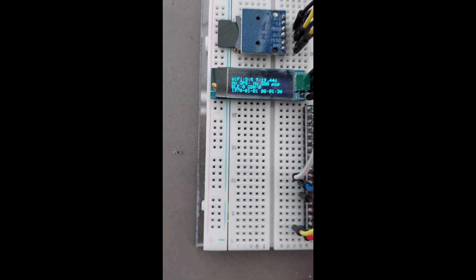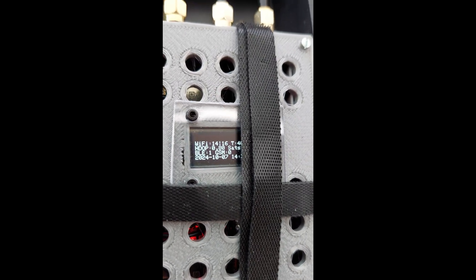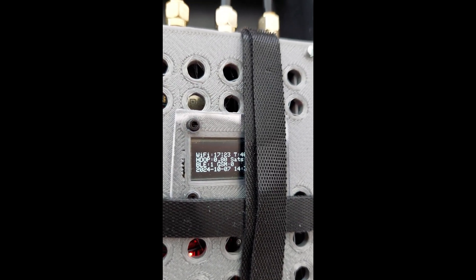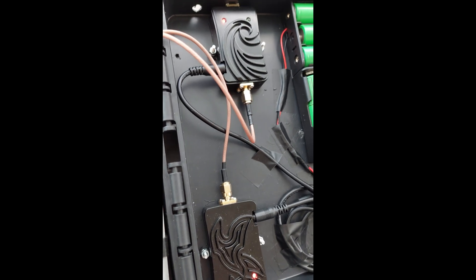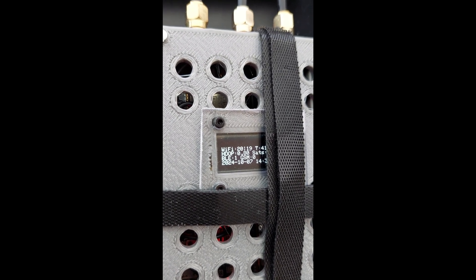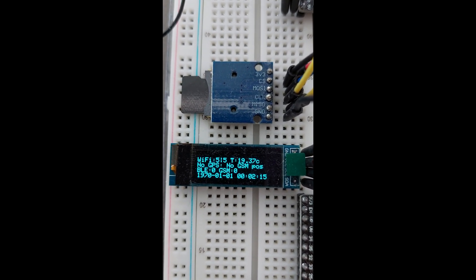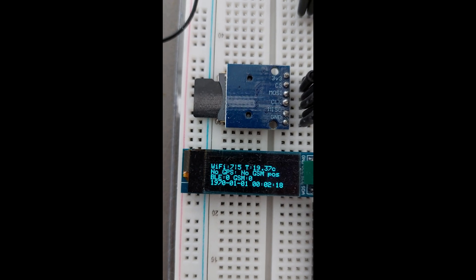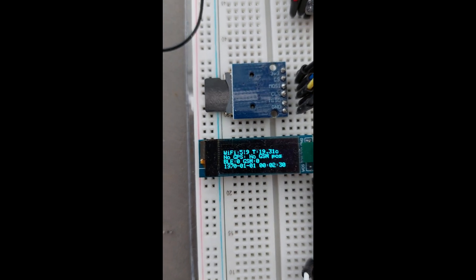We are expecting the next update soon. On this wardriver we have 6 networks for 2.4GHz and 3 for 5GHz, but with the amplifiers we have 19 and 16 — or even more: 22 for 2.4GHz and 23 for 5GHz with the amplifiers in the same location. For the other one not using any amplifier we have just 4 and 7 connections using a regular antenna for 2.4GHz, and for 5GHz we are using the antenna integrated into the module. There is quite a noticeable difference.